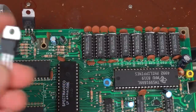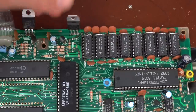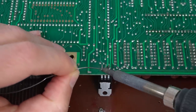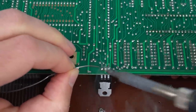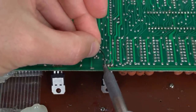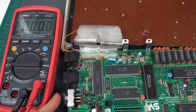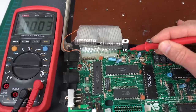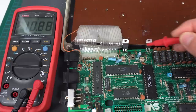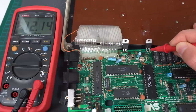And this is the 7812 - that one goes right in. Perfect. And now for the cable that was missing there - I think that's ground. Let's test the voltages. We get five volt output. Perfect. 11-12 input, and here 24 input and 12 output. Great.